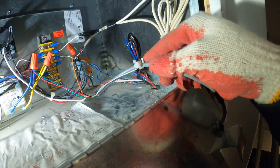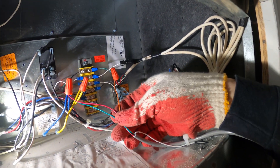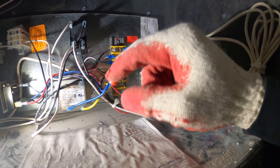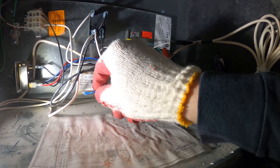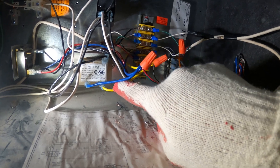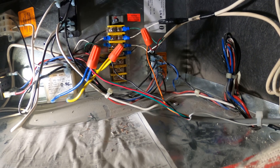Here's the opposite end coming out. The white wire I just taped off and isolated it. Let's go over what's going on here. Starting with the power — which was our red and black — we basically just connected that to our transformer. I put the red and green together and that comes into our hot line on our transformer, our 24 volts. Then the black I used as a common, so I put that to the other side of the transformer.